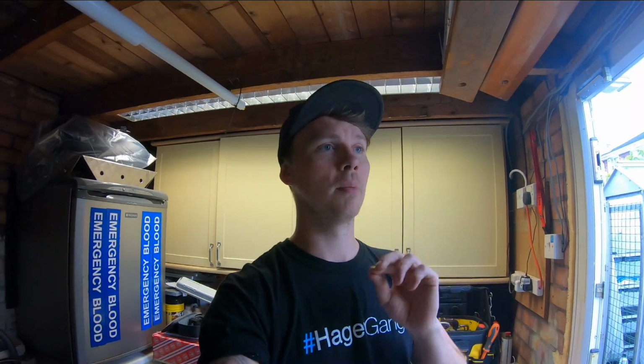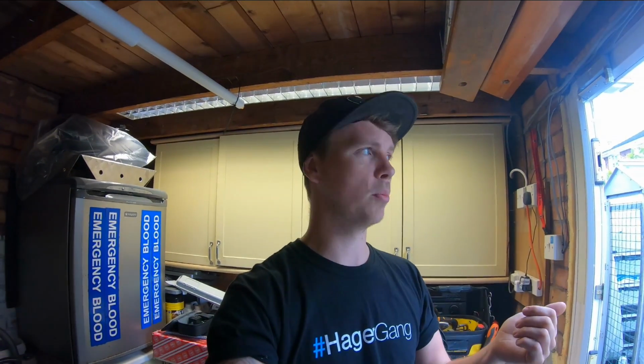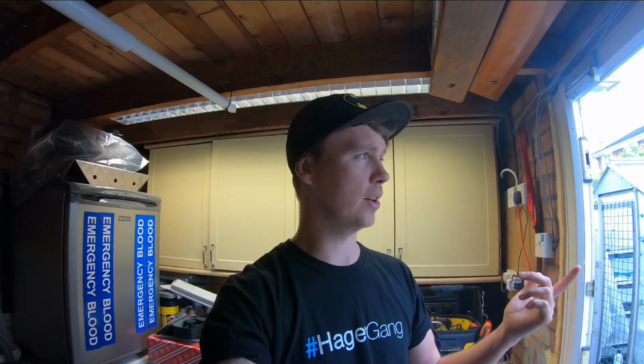So what it is, he put one board in to run the extension, but there still was an old rewirable one in the cupboard outside. So what I did was put all of that into an adaptable box, extending all the cables up into the new board on the inside of the house. Combined that with the other fuse board, the new extension, combined it all into one, and made it all back up to regs. Put new 10mm bonding into gas and water, 16mm earth, 25mm tails.